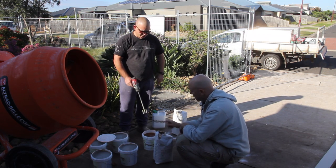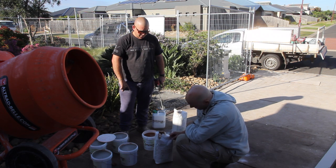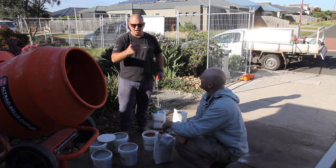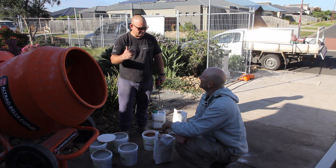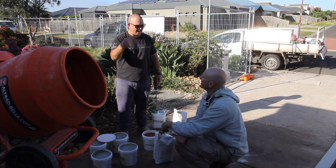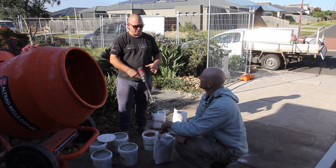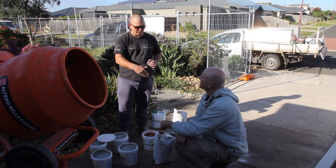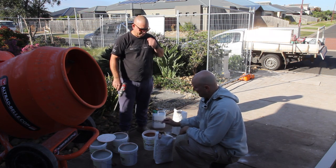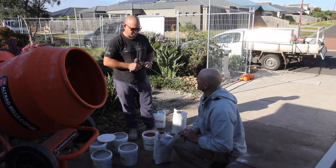With these bags of Graphenstone Mortar Fine — that's a fine sand, basically. They have four different grades: one is a Nature Glue used as a scratch coat for brick work; then a Mortar Base for high builds; then Fine and Super Fine. For our texture we use the Fine. So basically we're using filtered sand, lime, graphene, and that little bit of tint — and these will get mixed together.